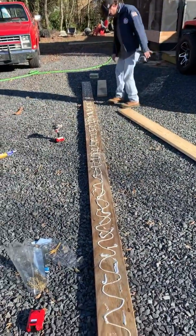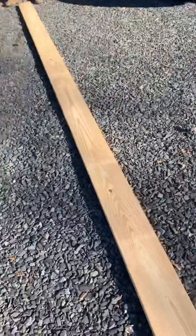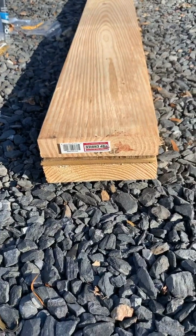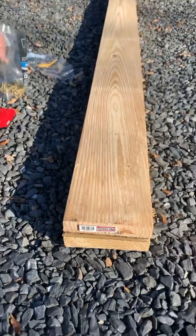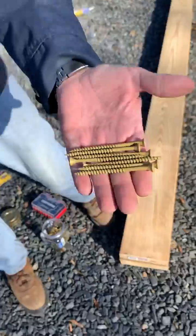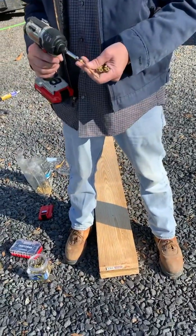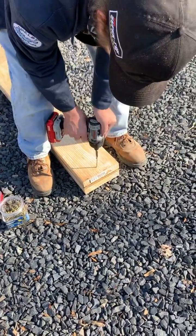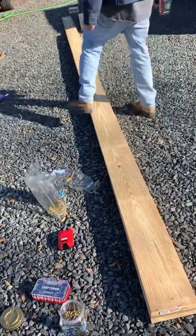We got the crowns facing the same way and the grain of the wood turning in. Okay guys, see this is the way the sandwich looks. Of course we're going to be trimming this end off to where we need it, but you get the gist of the idea. We're going to do longer screws this time — I think these are two-and-a-halfs.